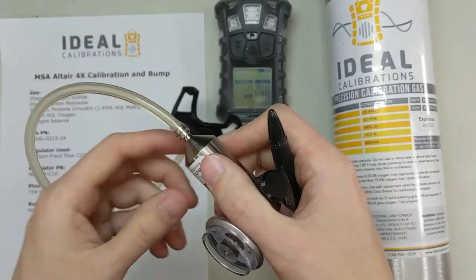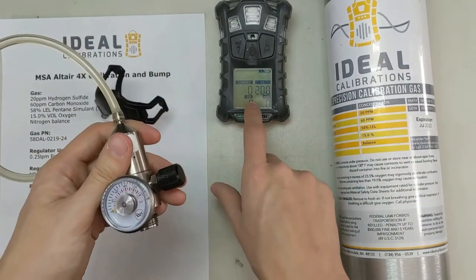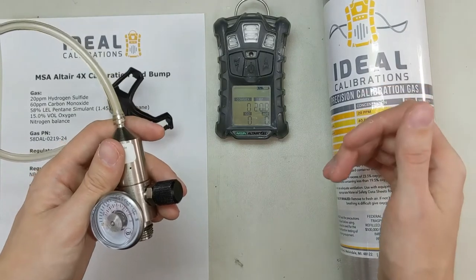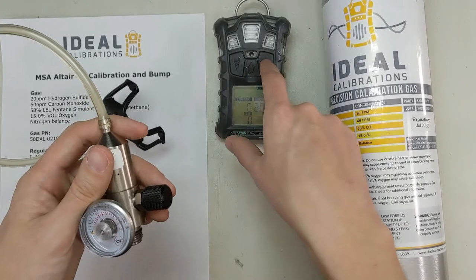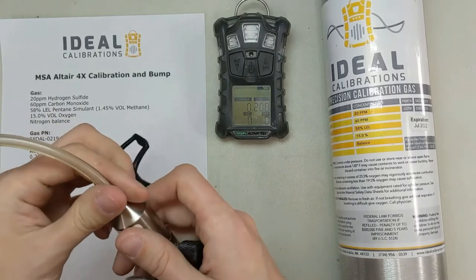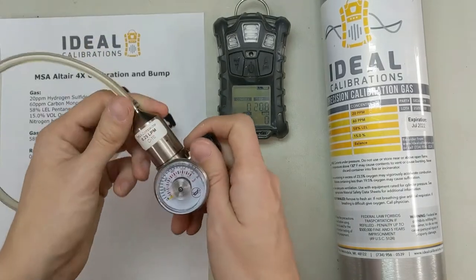Just make sure you're not using an open pen where you're going to get ink all over everything. In the background, it's asking us if we wanted to do an FAS. I don't like the FAS zero personally — I think it's better just to bypass it. You can hit the right button to say no, or you can just let it go. I prefer using a full zero or a calibration. The FAS is kind of a halfway zero with very low tolerances.